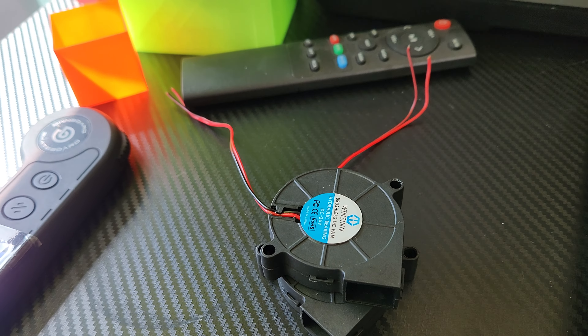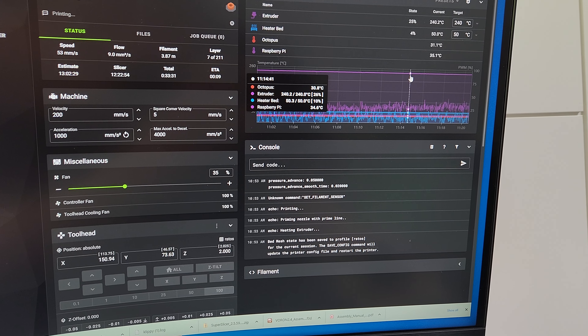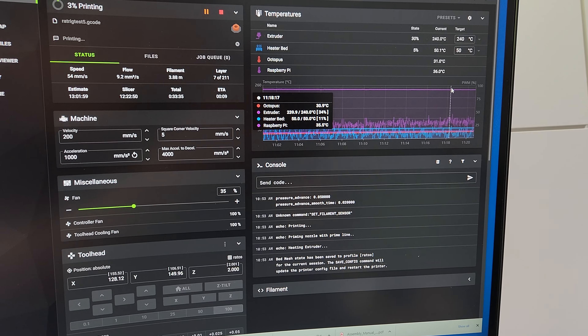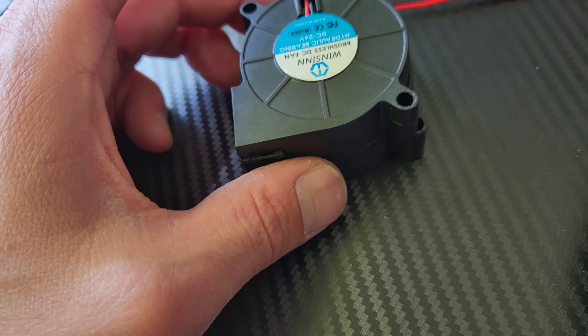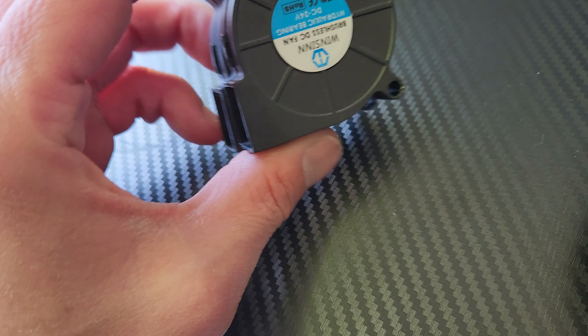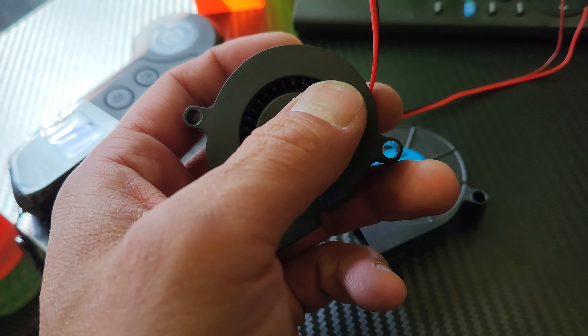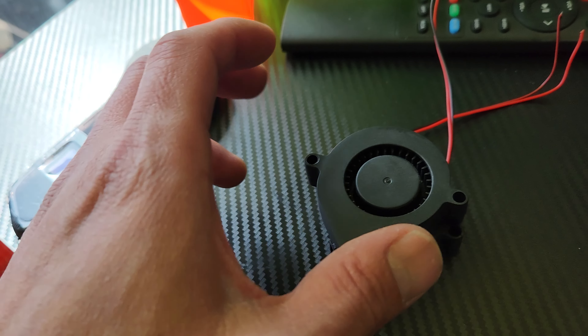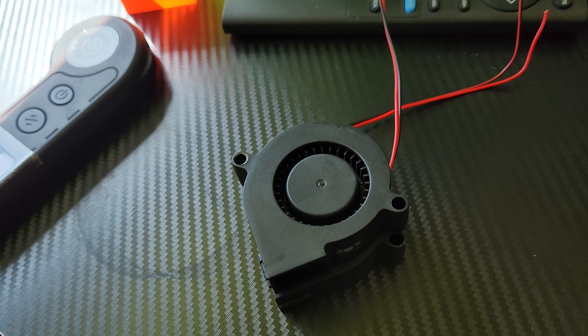But I totally don't recommend these for your part cooling. What happened was I had them running on my rat rig dual fan setup, and what would happen is when the fans turn on around layer 6, the extruder temperature would fluctuate. It was perfect at 240 but would fluctuate from like 235 to 256, and eventually cause an ADC range error.